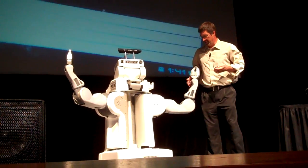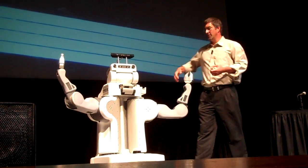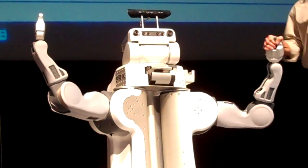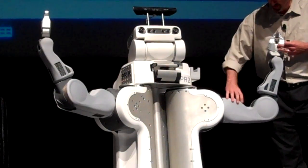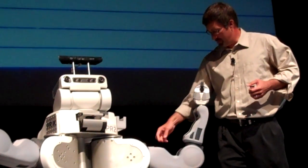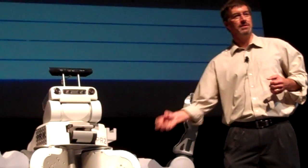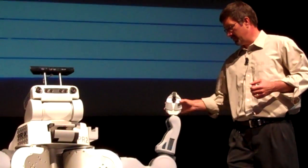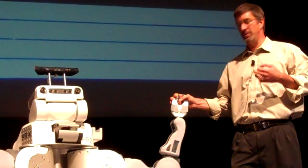In the Carson video, I'm standing next to the robot inside of its workspace, and I'm not too scared. The robot, even if it was trying to hold position as tight as it could, I could just grab it and move it. And that's by design. We've put the motors — even though it's got these massive biceps, they're not actually biceps, they're just a place where there's a fan — but it's got a relatively small motor up here, because that motor doesn't have to hold the whole arm up; that motor can just hold the payload, which is designed to be about five pounds. So you're pretty much stronger than it.